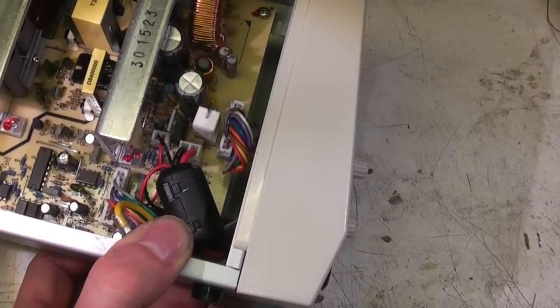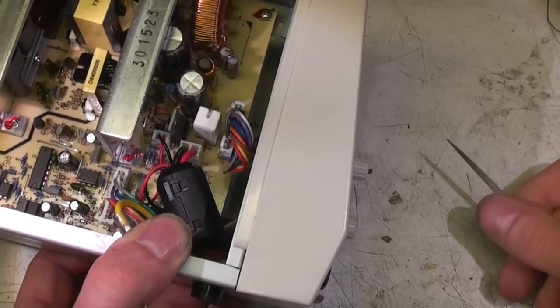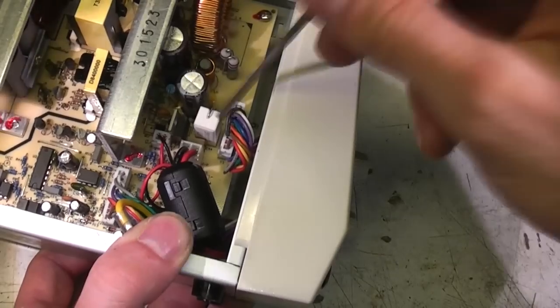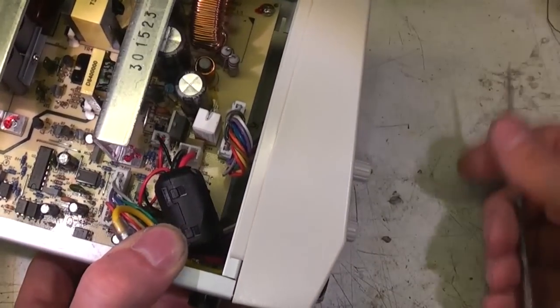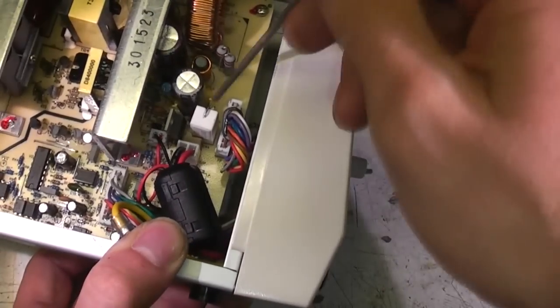I think the reason they've used a big resistor is partly to make it reasonably rugged against transients, sudden load surges, but also you don't really want your current sensing resistor getting hot because that's going to affect its accuracy. So I think that's perfectly okay.